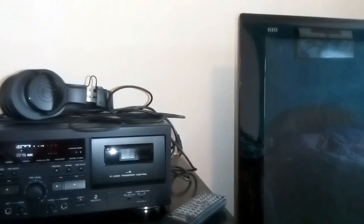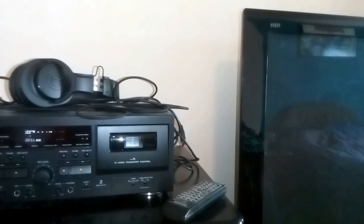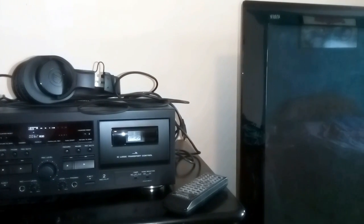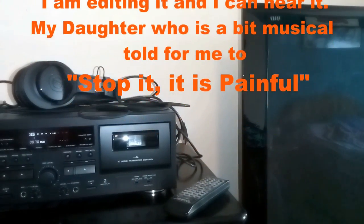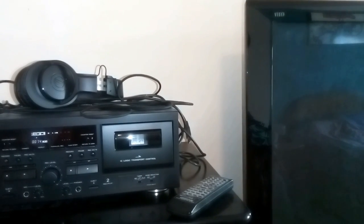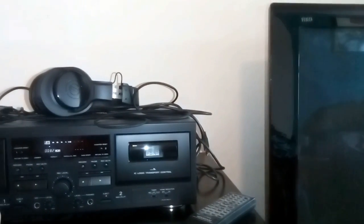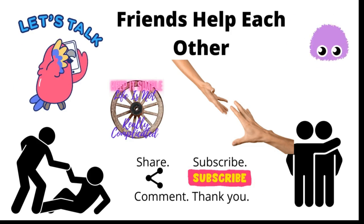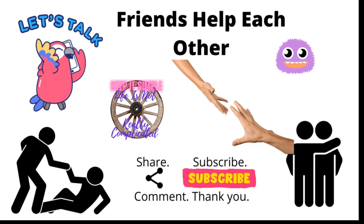Now what I'm going to show you here is what happens if you do a big change. I'm going to slow the cassette deck down. It sounds like a really bad group has started playing. Now it's back to normal speed and it just sounds out of time. I'm going to speed it up. As you can hear, that sounds really awful. But if you get it close to the right speed, it just sounds out of time, not out of frequency — and that's what you're aiming for. So that's a way of doing it.